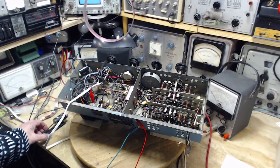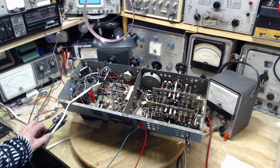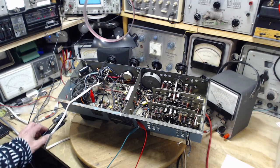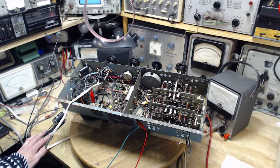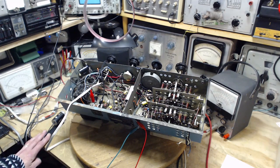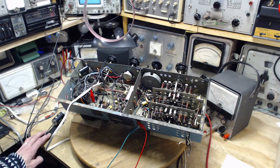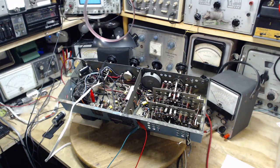Now, many of you are going to know this. Generally, individuals watching my video are pretty far along in all this stuff, and understanding input impedance in a voltmeter, that's pretty basic stuff. Ohms per volt is simply a way of describing the impedance of a meter such that you can know the true impedance on any scale setting. If you change scales with meters, their input impedance changes.